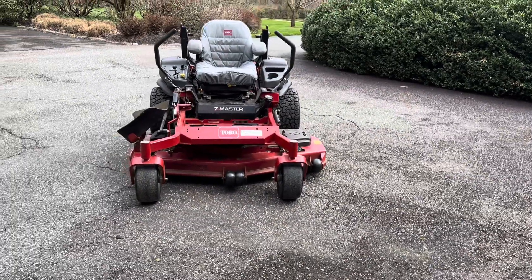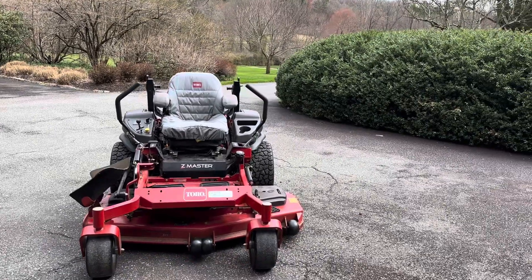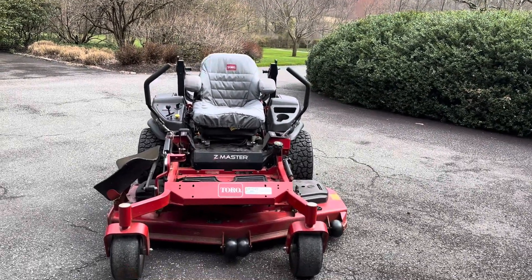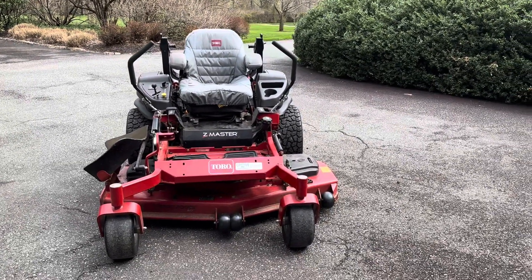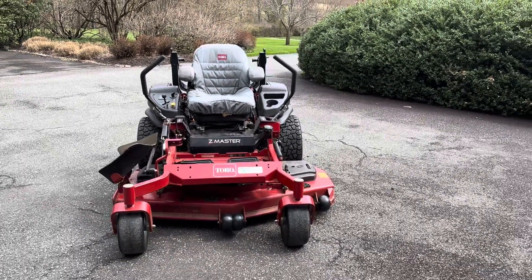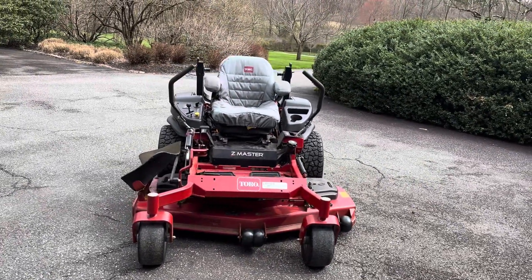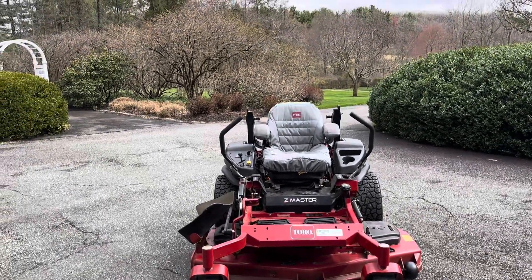When you're cutting something thick, dense, and consistent, there's no area where a big swath of air is going to suddenly come under the deck and ruin your cut. But say you're cutting a consistent yard and there's a big broadleaf plantain that sits at a much lower height than the surrounding turf — it's going to introduce a pocket of air that disrupts your cut. That's why those changes hurt cut quality so much: it comes back to controlling the air.